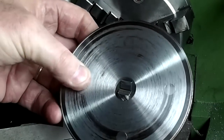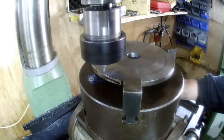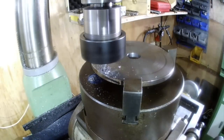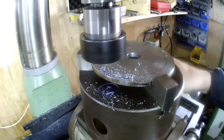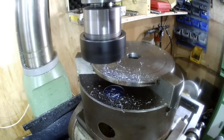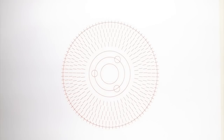So I've decided to make the entire set of index plates for the 90:1 dividing table using whatever method I can. Starting with the plates for these, I used a bit of scrap metal and I filled the holes with a bit of weld. I already know I can cut 8 of the 25 holes using the 40:1 dividing head, but the other 17 holes involve me having to use the computer and the CAD program again, and with a little bit of luck and sticky tape I managed the remaining 17. Yes, I literally meant sticky tape and luck.